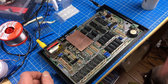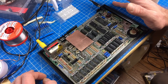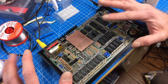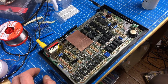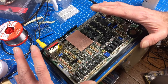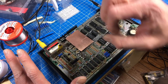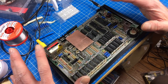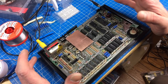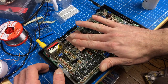As with all these old computers, always take care of the power supplies. The power supplies of the ZX Spectrum are legendarily failing too - like the Commodore 64 ones they are very cheaply built. Basically use a good nine-volt switching power supply. Take care with these connectors: center-negative in this case, whereas modern ones often have center-positive connectors. The Spectrum and some old electronics are center-negative, so take care to get the right polarity.